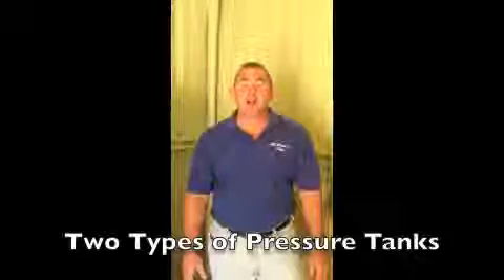My name is Jim Tomlinson from All American Water located here in Wise County, Texas. We've had the opportunity to use somebody's well house that has two different kinds of tanks. This morning we're going to talk about both, one of which you're going to have in your house. Here to my left and to your right is what we call a bladder tank. Typically bladder tanks are more often than not blue, but this one is white. You can also tell it's a bladder tank because it has a valve stem up here — this is where the air is put inside when they're pre-charged.